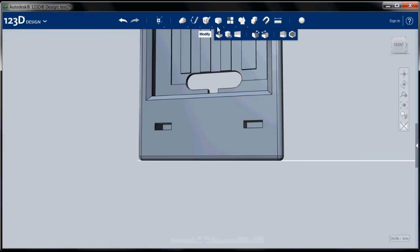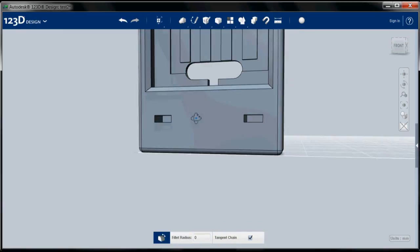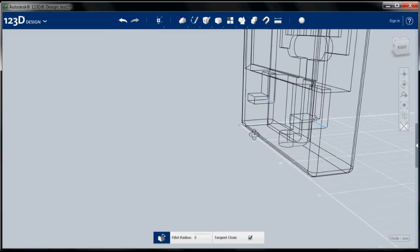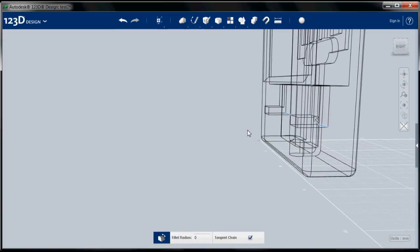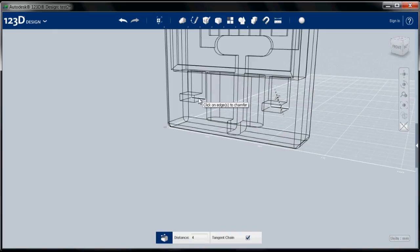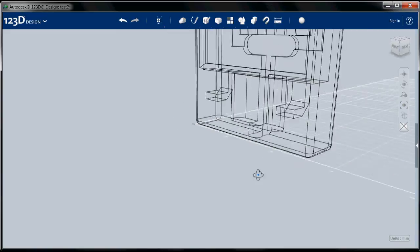Okay, now, for the speaker and the microphone, we want the sound to get in and out easily, so we're going to make horns on these. So let's finish this operation and fillet again. Oh, actually, first thing I'm going to do is go to this back angle. I'll turn this off so we can see outlines only. So the sound doesn't have to make a right angle turn, I'm going to put a surface there with the chamfer function. And I'm going to go for like a 4, maybe. That looks like I've lost my selection, so. Okay, so there. Finish that.